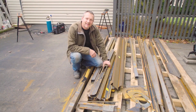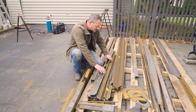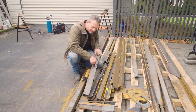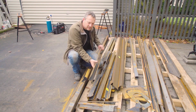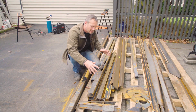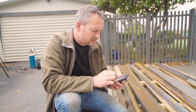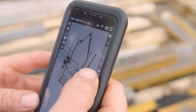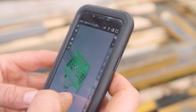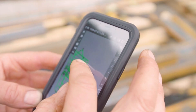It's been a couple of weeks since we had the arrival of this trailer. Today we're going to start putting it together, so that's pretty exciting. The great thing with the laser cutting and folding is that it's all very precise — we've been able to remove a lot of weight in the trailer by having these sections cut out. We've got locating lugs and locating slots for the steel, so when we go to weld it together it'll be basically like a jigsaw puzzle and should be true and very accurate.